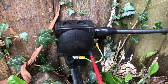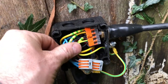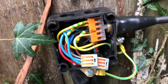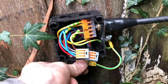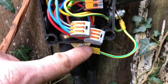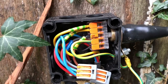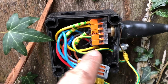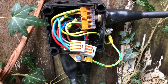I just wanted to bring your attention to the neutrals, the line conductors, and the CPCs. I've also done this — I'd run out of the normal way of connecting these up, so I've used two little earth rings and then through a little stainless steel nut and bolt it connects through here to ensure continuity with all of the armoring. I've also joined that back into the earth as well. It's not ideal how I'd like to have done it, but it's ten times better than how it was.